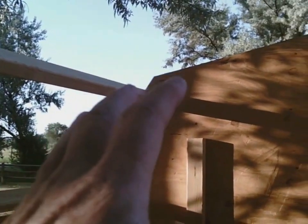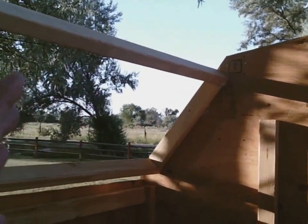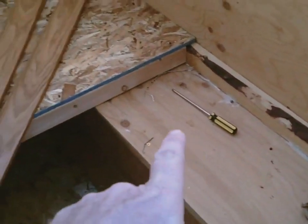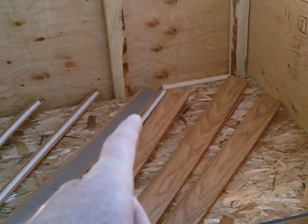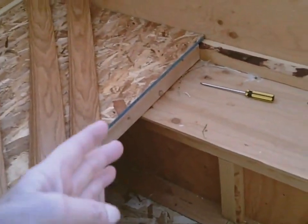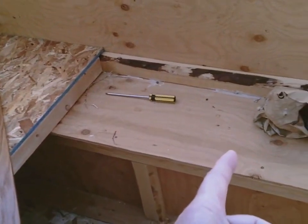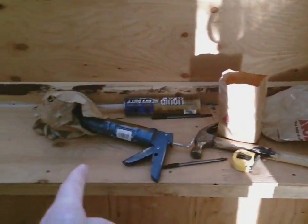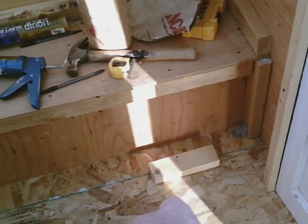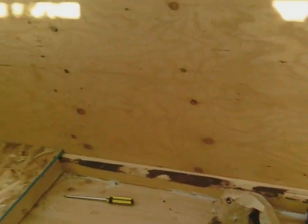Total material costs so far have been kept at a running total of right around $300 — for half-inch plywood, two-by-three framing, two-by-four floor framing. OSB was used on the floor since it was about half the price of plywood, while plywood was used on everything else for better weather resistance. The bed is made from OSB sheathing and is 32 inches wide using an existing cot mattress, positioned low for easy sitting rather than as a platform bed.